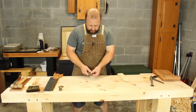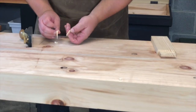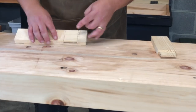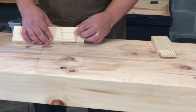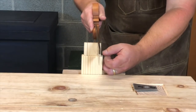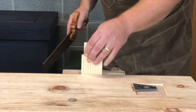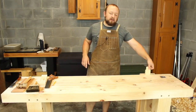You can plane a pretty thin wedge, and when done the wedge should match the angle we've drawn on our stock — that's right where it should fit, at the approximate bottom of the mortise. To prepare my tenon, I'm going to make a couple of saw cuts just about all the way to the baseline. I'm using a really thin saw here — I don't want to remove a whole lot of material. It's not that important if these saw cuts aren't perfectly straight since they'll be hidden inside the joint anyway, but I tend to draw myself some guidelines.